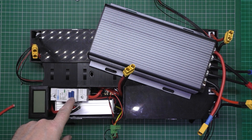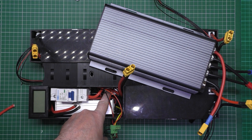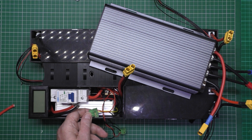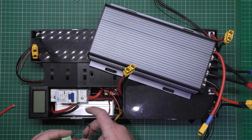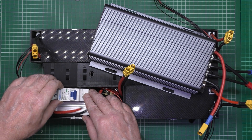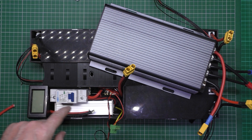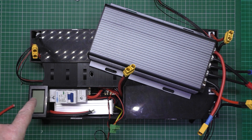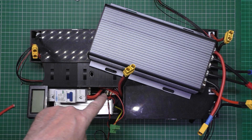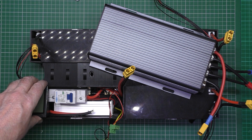I've figured it out. I'm having the breaker there, the current and voltage sensor readout there, the shunt's going in there, and the regulator will go there. I've just got to extend these wires again because I've cut them just to the right length, as usual. That'll go through there. What I'm going to do is design a case that holds that in place and holds everything. Because if anything shorts out on this I'm going to be in trouble - it's sitting on top of the shunt, probably about 10mm proud.